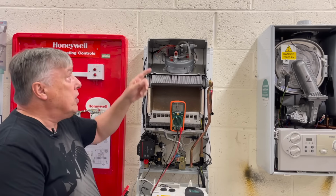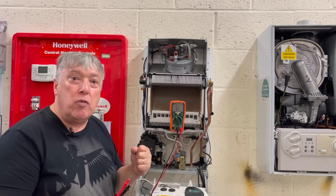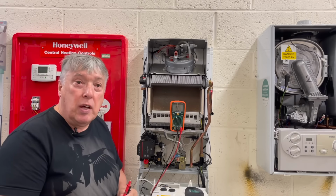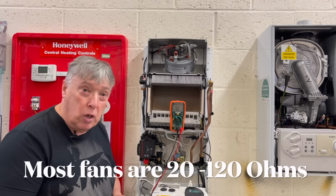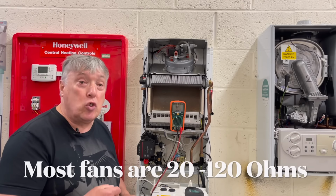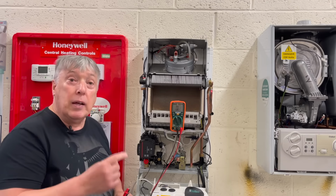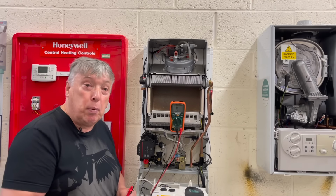So that copper wire goes round and round, and it creates a resistance. And on normal single speed fans, that number is between 20 and 120 ohms. So when I measure this, I can see whether the flue is long enough or the fan is good enough to remove the fumes of combustion outside to the atmosphere. And of course, age has a big play in this.